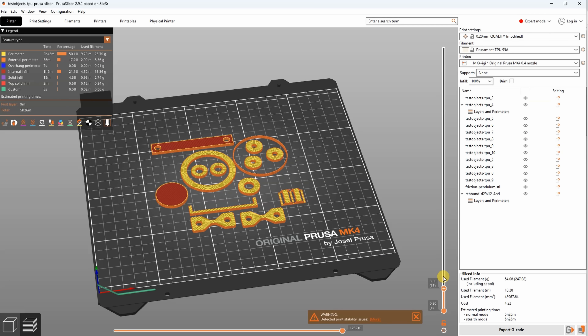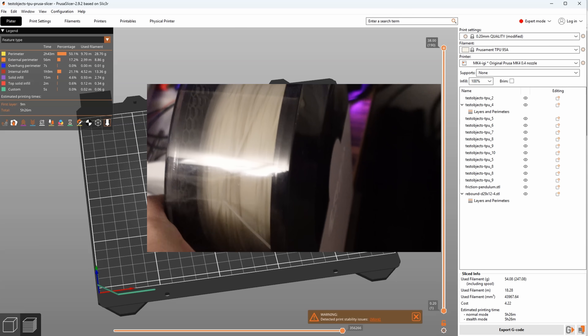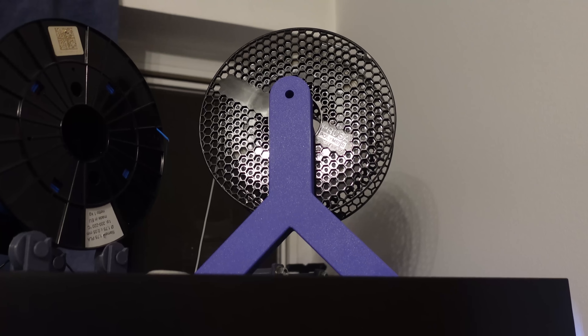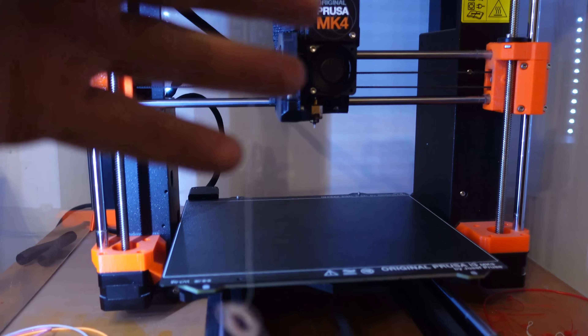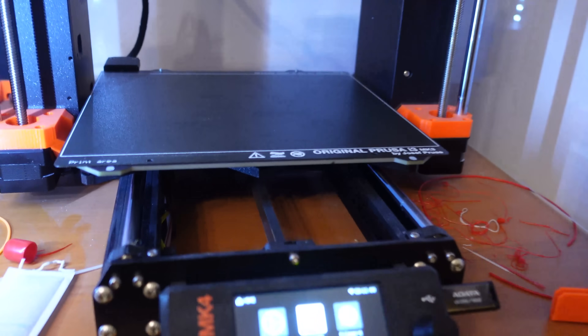For drying, they recommend 4 hours at 60°C, and I personally like to print from the filament dryer. Earlier TPU printing was very slow, and printing from a filament dryer helps a lot because we always dry the outer loops and keep conditions more constant. These are my regular test objects for TPU filaments — all solid inside. The TPU 95A profile is included in Prusa Slicer and printing time will be 5 hours. It was dried for a few hours but printing will be from open air, which I'm not happy about for such a long print.